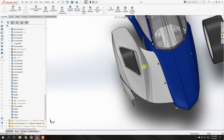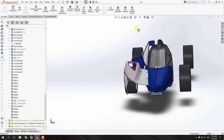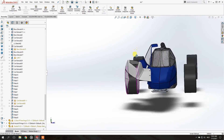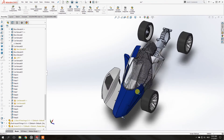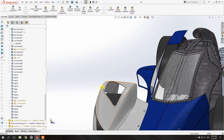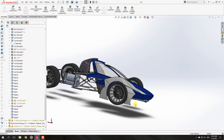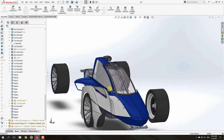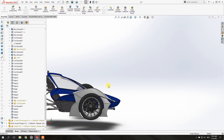Now you can see this gaping hole through there. For racing applications I would just leave nothing there — if you look at modern Le Mans cars, they also have it over the fenders. In their case it's to prevent the car from rolling over on those long straights, because this doesn't allow a high pressure zone to form underneath the fender that could possibly lift the car.